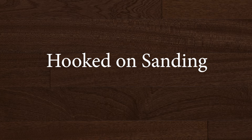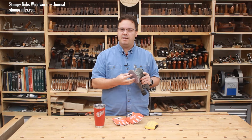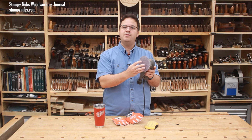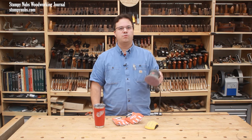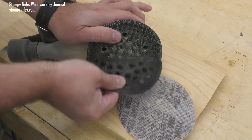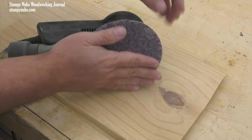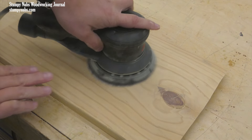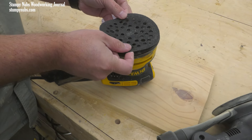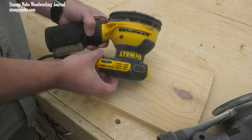The pad on the bottom of your sander is covered with little plastic hooks that connect to the tiny loops of your sanding disc — you should take care of these if you want your sander to have a long life. One way to do that is to store your sander with the sanding disc on it to help keep the hooks from getting smashed down. Consider getting one of these — it's called a Hook-It. One side has loops that attach to your sander's pad, the other side has hooks that attach to your paper. The wear is on the easily replaceable Hook-It pad instead of the sander itself. It's universal for pretty much any sander, and it's one of the best $6 purchases you will ever make.